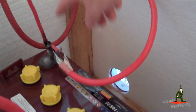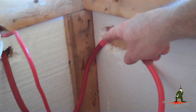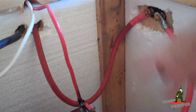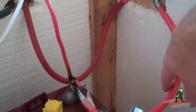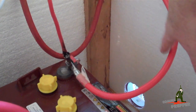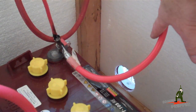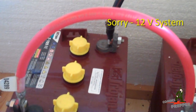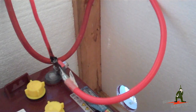Below that I have number 2 copper wire going into the inverter. Off the positive post of the battery I have number 2 wire coming up to the main on-off switch, which then feeds back into the crawl space to turn the inverter on. I'm using number 2 wire because I have a 1500-watt inverter and it can pull up to 150 amps of current at max — you definitely don't want to undersize your wire. The size of wiring does matter when you start pulling a lot of current through your solar system.